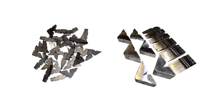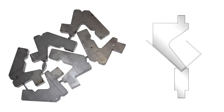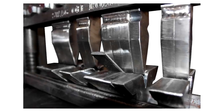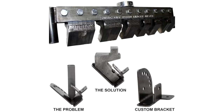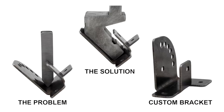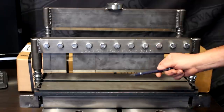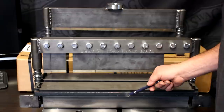The hemming die and gooseneck die racks are laser-cut from half-inch thick steel plates, ready for you to cut apart and assemble to whatever finger length you desire. The hemming dies allow you to make an extremely tight radius bend — the first step in folding over a hem to strengthen the edge of the material. The gooseneck dies are for custom bracket making, adding just enough clearance so the material won't run back into the finger on the brake.